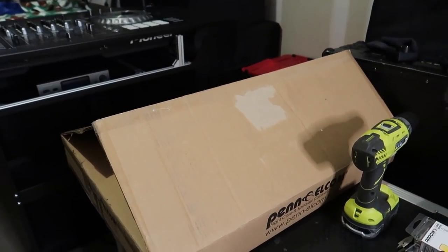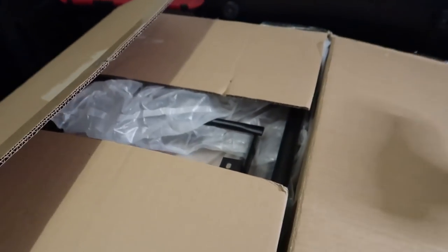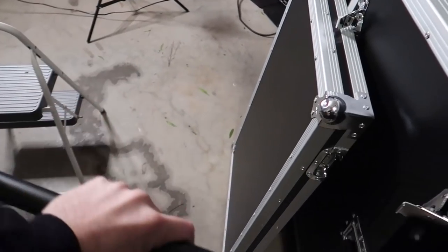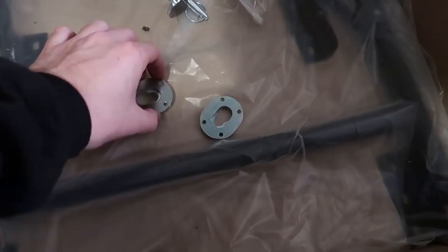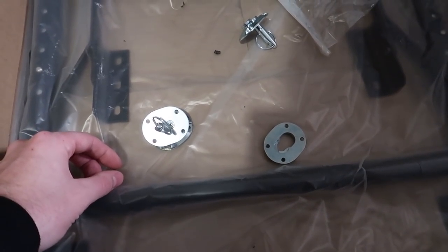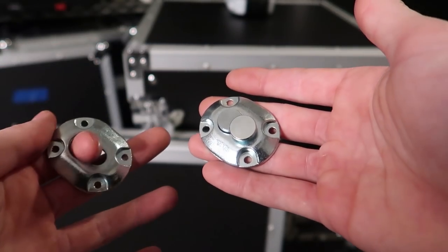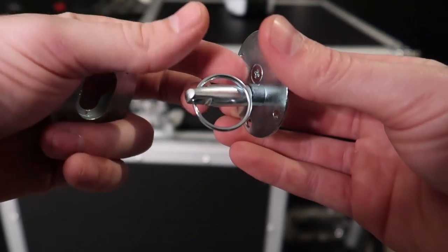Finding the parts to do this online was actually really hard. I found them on a website I'll link in the description down below. Inside the package we have the table legs, which extend to different dimensions. We are going to be riveting this set of legs into the actual lid, so we have a fold-out set of legs on each side — I have two sets. Now these are kind of the connectors we use to connect the lid to the side of the rack. This flat piece will go on the side of the rack, and this piece right here will go on the side of the lid. We drill a hole big enough to put this little thing inside of the lid as well.